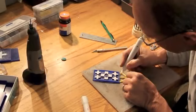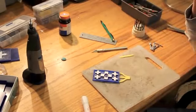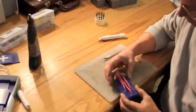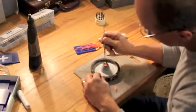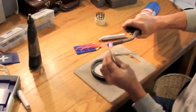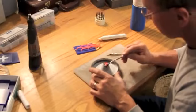When I've got the model done to my satisfaction I'll begin attaching sprues to the model. The sprues will eventually allow a place for the wax to melt out and the silver to be cast into the finished mold. Here's a picture of the sprues attached to my buckle. Then when the model is done I will attach it to a rubber base that will go on to the bottom of a flask.